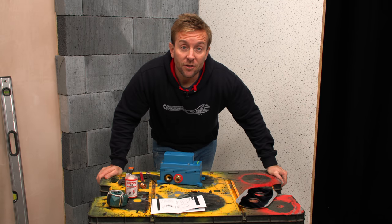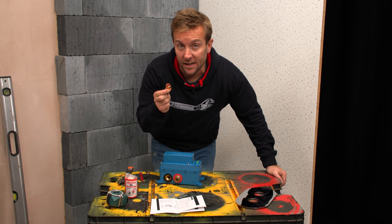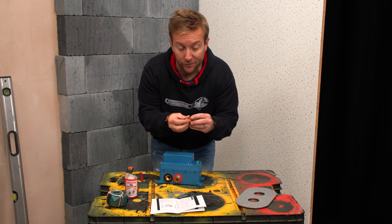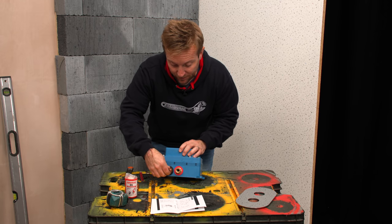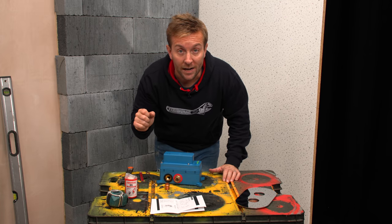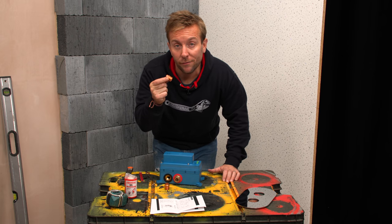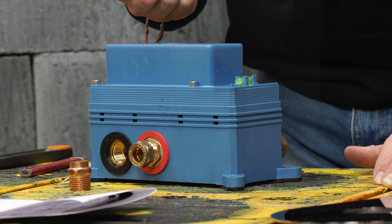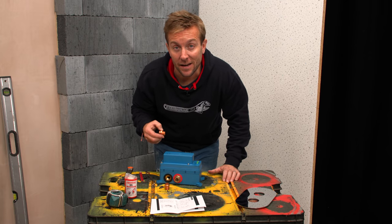For the outlet that goes to our handset, I'm going to put a soldered fitting in here — a straight bit of 15mm pipe. I'm going to solder that on there and then screw it into the side of the valve, because all that's going to do is come out sideways and come straight out the wall to our connection plate. For the pan head, I'm going to 90-degree out on our solder fitting out of the right-hand side of the AquaHeat valve, and just run that up by about six inches and then terminate it there for now — because then we're going to go over to the very fun bit, chasing the wall out.